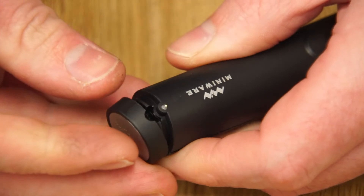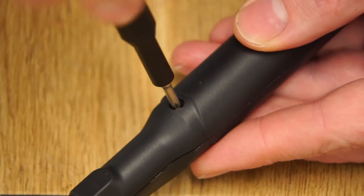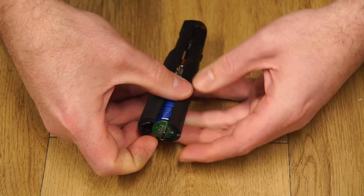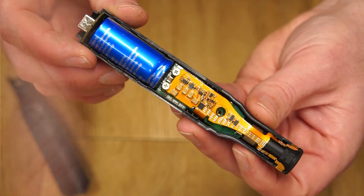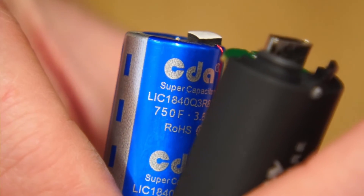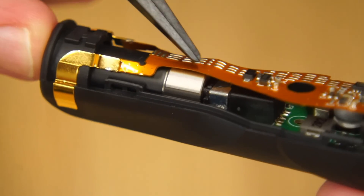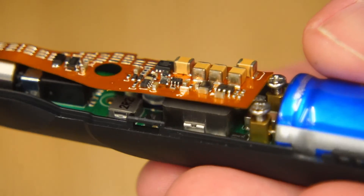Before we wrap up the review, let's open the iron and take a look inside. At the rear we have a CDA 750F 3.8V supercapacitor which stores the power for the iron. The charging pads connect to a ribbon-type cable with SMD components on it — something I haven't seen before. Other than that, there's not really anything of particular interest going on here.